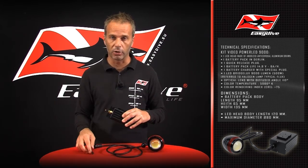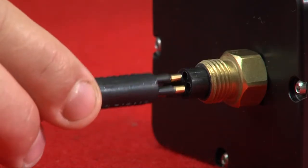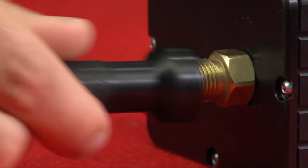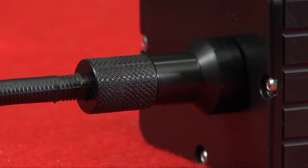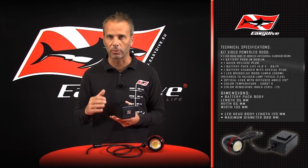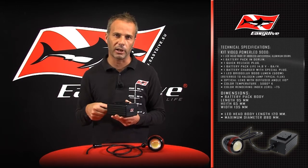The connector serves to join both the light head and the battery charger. Recharging is achieved with great speed and can last between two to three hours depending on battery pack status. Within the battery pack a circuit board has been placed to monitor and protect the battery cells, preventing damage due to overcharging and also keeping a balance in the charge and discharge over each cell, meaning all of the light's features can be exploited equally.